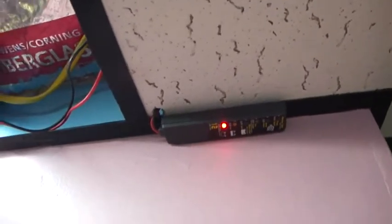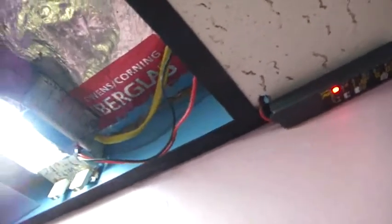This is powered by a solar panel outside, and this 12-volt system with the six 12-volt fluorescent lights works very well. It lights up the whole room, and depending how much power you have in your storage, you might last about eight hours on this system.